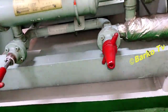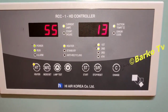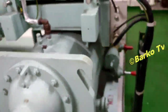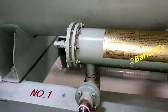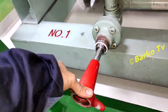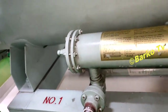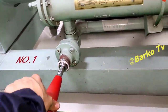This bypass valve is for when you service the filter dryer. Right now it's at first stage and second stage — the second stage is 67% capacity. Now I will close this valve after the condenser. This isolation valve is at the top after the condenser — that is the sight glass so you can check the flow of the system.